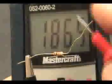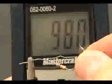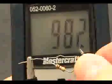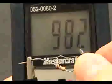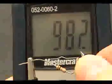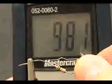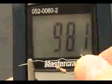So now I'm going to check out the resistance of this resistor. What does it say? 982 ohms. What do you suspect it is? It is a 1K ohm resistor. The alligator clips really come in handy to hang on to stuff. It could have been 1,040 or 950 — plus or minus 10% roughly.